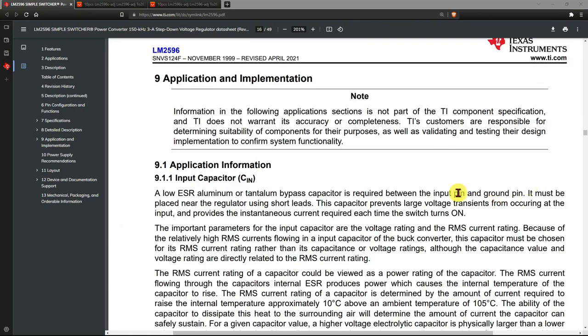This datasheet actually has the application notes attached to it, which is good. It's telling us that you need to make sure, which is true for all switch mode power supplies, that you have low ESR capacitors, either ordinary electrolytics or tantalums. This is very important with switch mode power supplies, because as you saw, this thing is running at 150 kilohertz. So the output actually has 150 kilohertz, usually similar to a square wave or some sort of waveform coming out of it, which has to be filtered by the output capacitor and the inductor and the diode that is there to rectify it